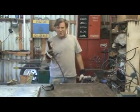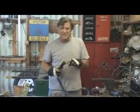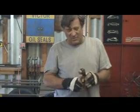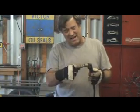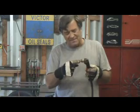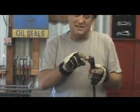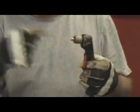So this is a plasma torch, a plasma cutter torch. It runs on electricity and compressed air. When the air comes up through the gun, there's a little chamber inside that makes the air swirl. Inside this little tip there's a nozzle, and you get an electrical arc going across that — that's what creates the plasma. Then you get your flame coming out.